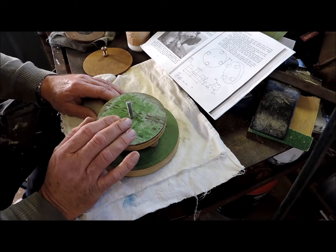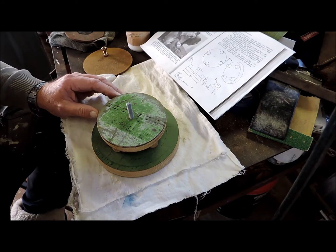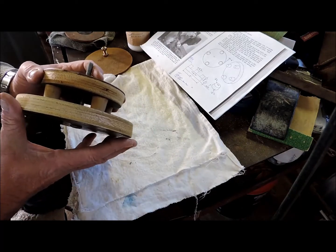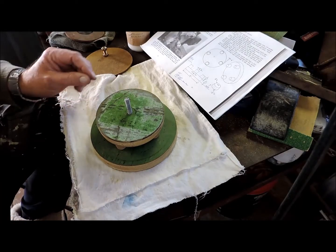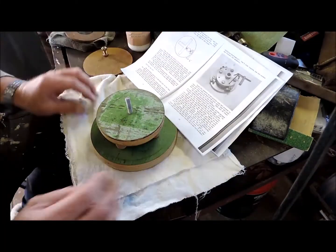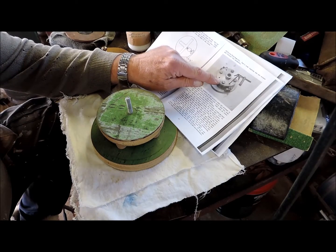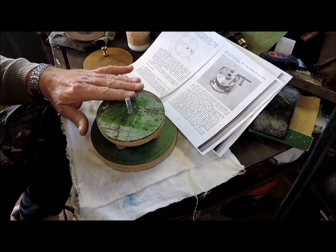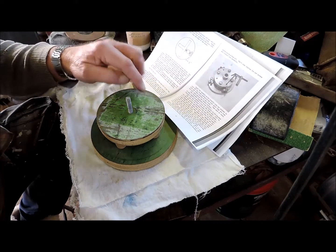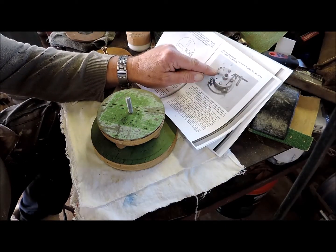I was thinking, because I'm not going to put the hub on the back here, and it's not running off the Gingery spindle, it's going to be bolted up to the mini lathe spindle. The bolts that go through to hold these two halves together, in Gingery's book, you can see that the heads of the bolts come through the back here. But that face is the one where you can see the hub. Well, I won't have the hub, and this face here will be mounted against the lathe spindle. So I've got these four bolts in the way.